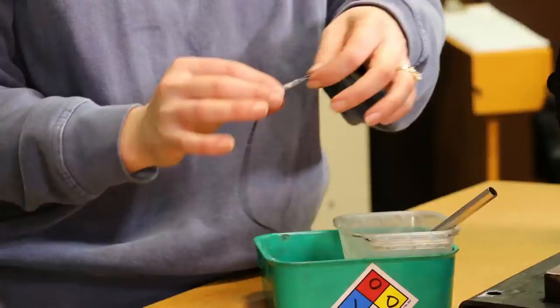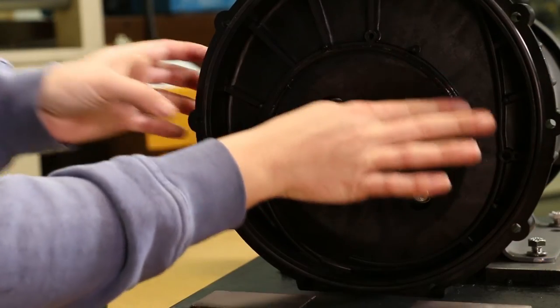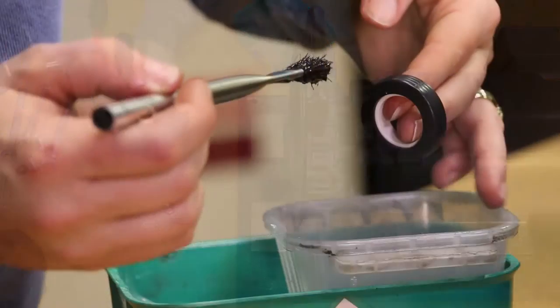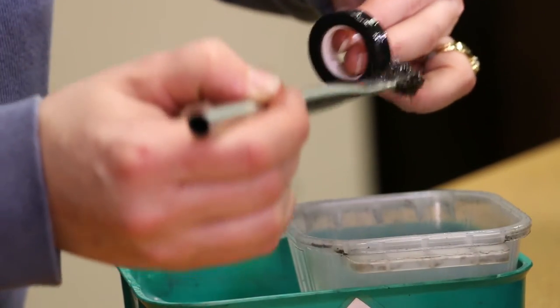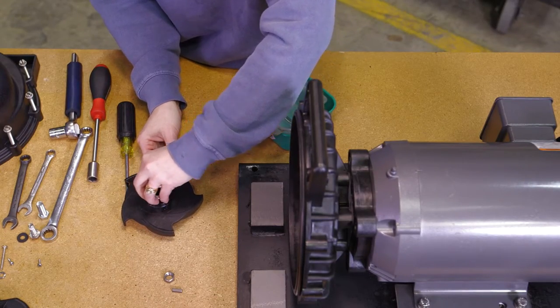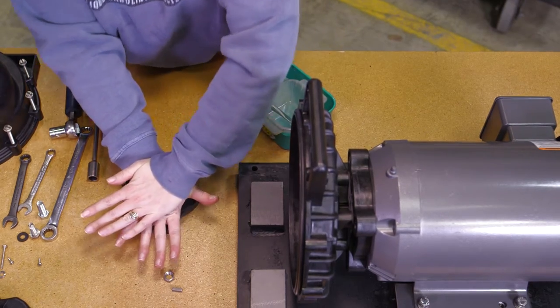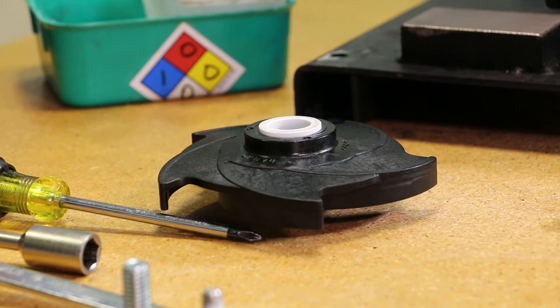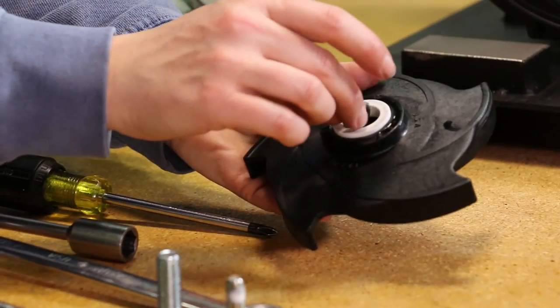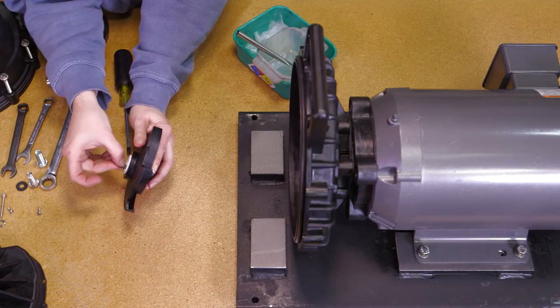Install the o-ring segment onto the rear bracket after lubricating with petroleum jelly. Install the ceramic seal half into the impeller. Be careful when handling the seal to not scratch the seal surface. The outside diameter of the rubber boot may be sparingly coated with silicone to ease installation. The seal half is pressed into the hub of the impeller by hand, but make sure to press uniformly. It's important to be absolutely sure that the ceramic seal half is bottomed out and installed squarely. If the installation is not square, seal wobble will occur, leading to premature seal failure. Place the hex nut, then the impeller key in the slot located inside the impeller snout.